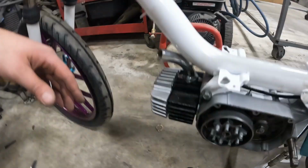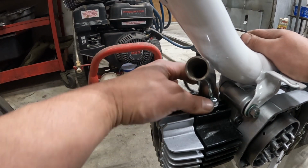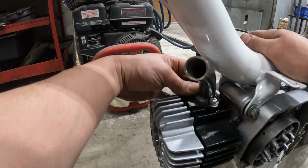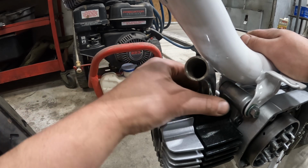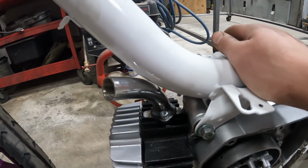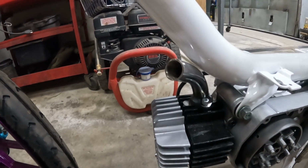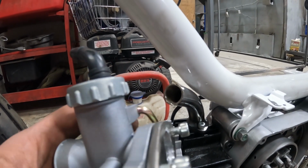On by the intake. This works, clears the frame, so I'm like 3/4 of the way. I actually need shorter bolts here. I only have 1-inch hardware. I don't have a lot of metric. Looks tight, but it's a fixed piece, so there's enough clearance there. Probably an 1/8 inch or so. I don't know how well that's going to show up. Then the flange and the carb.